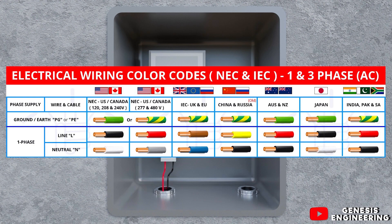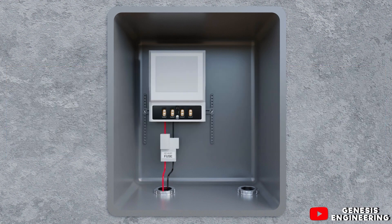The color of the phase and neutral cables will depend on your region. I am using red for the phase cable, black for the neutral, and green for the ground. This is important to check in the electrical installation. Depending on the region, there may not be a main fuse along with the meter — instead there will be a main circuit breaker.